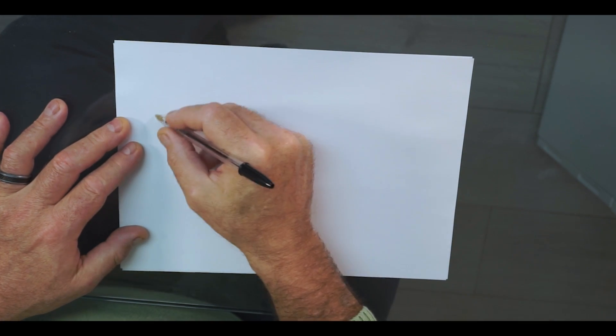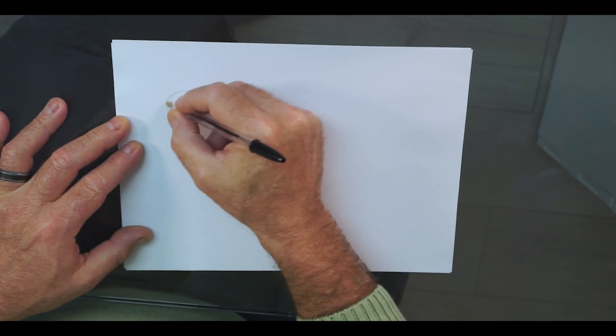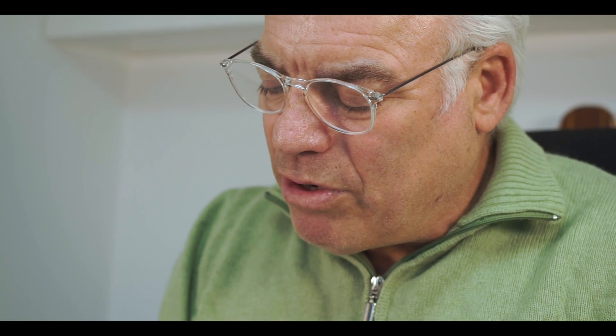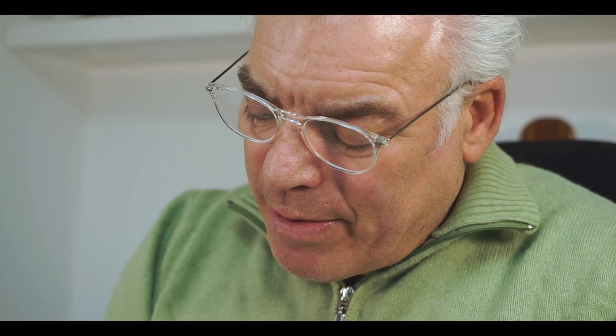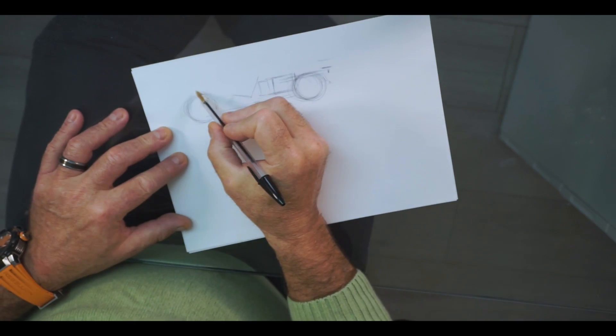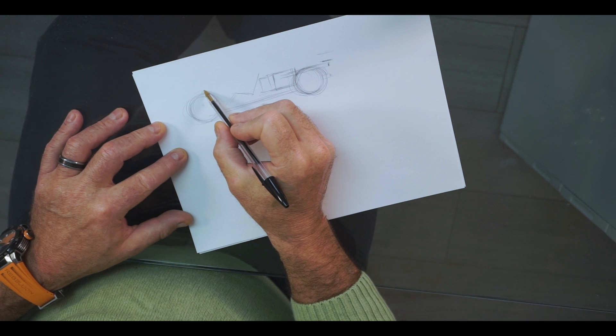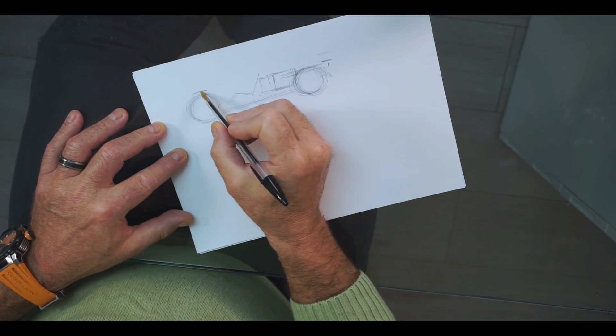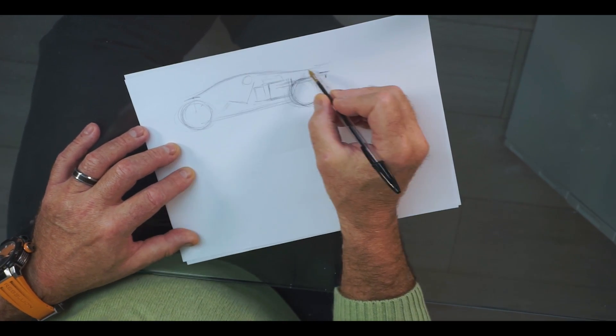If I start to put some lines on paper, I'll show you a little bit of what I mean. I set out a wheelbase that pretty much represents the car I'm working on. Saying that's going to be the height of the back of the car, you're already looking at something that is extremely low, which is already dramatic — you're already starting to think this is not normal. We want a cab-forward look because we want the driver to have a command driving position where the road is right out in front of him. We want the center of the wheel to mark the highest point on the fender, so that the driver, when he views forward, knows the highest point of the fender in front of him is actually the middle of the wheel, so he can place the wheel in the corners exactly where he wants.